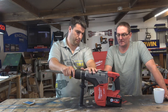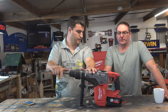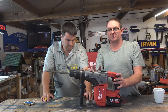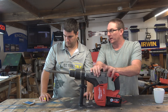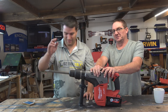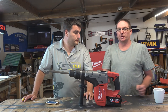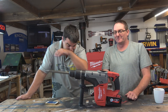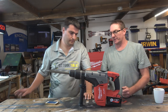In terms of features it's very plain - just chisel mode and hammer drill mode, it doesn't even have a regular spinning drill-only mode. The weight is about 6.7 kilos which does get a little bit heavy, but you're not using it all day above your head. A lot of the time with this you're going to be drilling down or straight in front - you're not going to be doing 150 holes above your head.